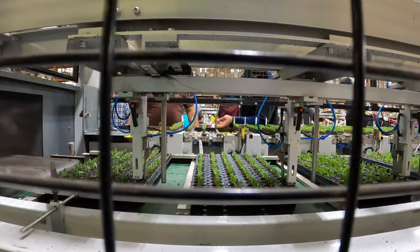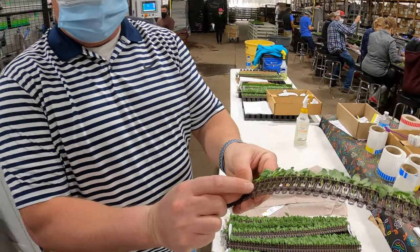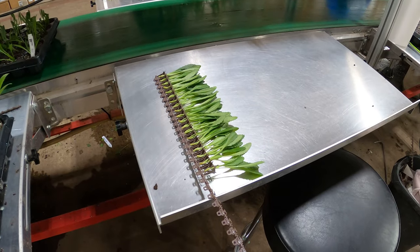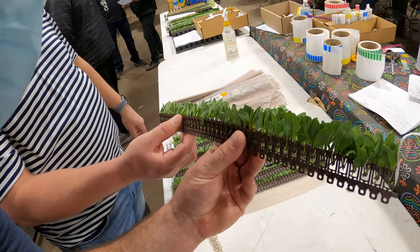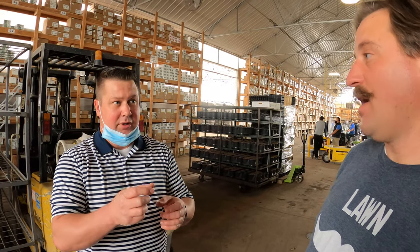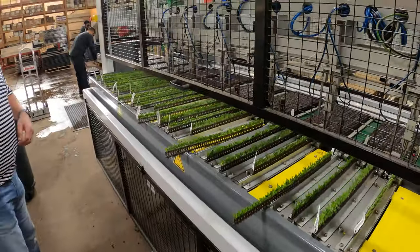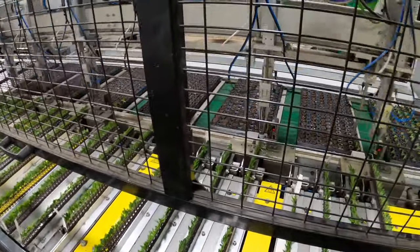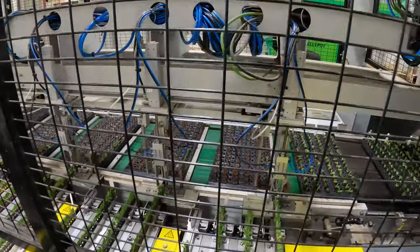Then the new way is a machine called auto sticks. There's a cartridge — when they take the cutting down in Central America or South America wherever the mother plant originated, right at that mother plant they'll take the cutting and stick it into this cartridge. Instead of a baggie, they'll stick it into a strip that's ready to go. The plants aren't rooted — they're just fresh cuttings. The machine cuts each individual cutting out of the strip with a piece of degradable material, like a plastic but biodegradable, and then plants it into the pot for us.